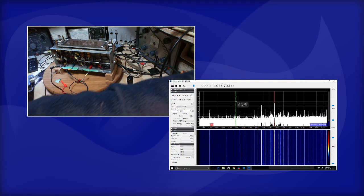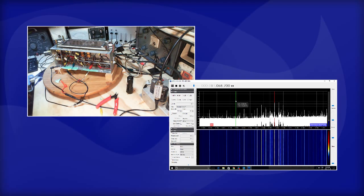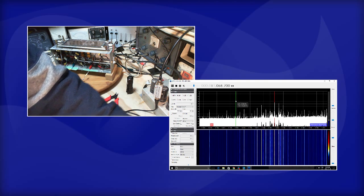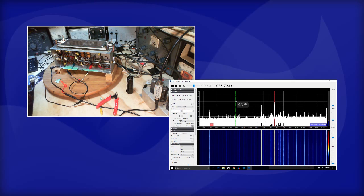Okay, let me switch on the radio here. Watch for the IF to come back. Hey, oh, I unplugged it. It's my usual: waiting for a radio that's not plugged in to come on. Here we are, plugged in. Switched on. This time we'll see something come up right around 10.7.